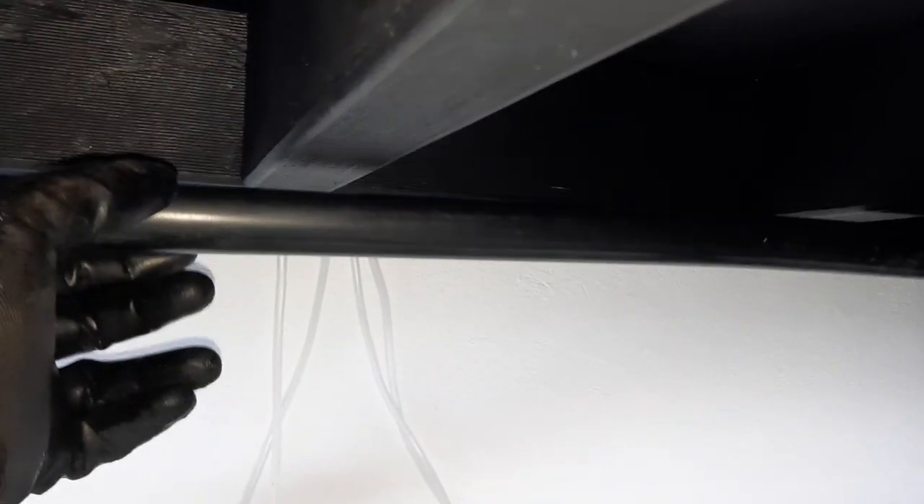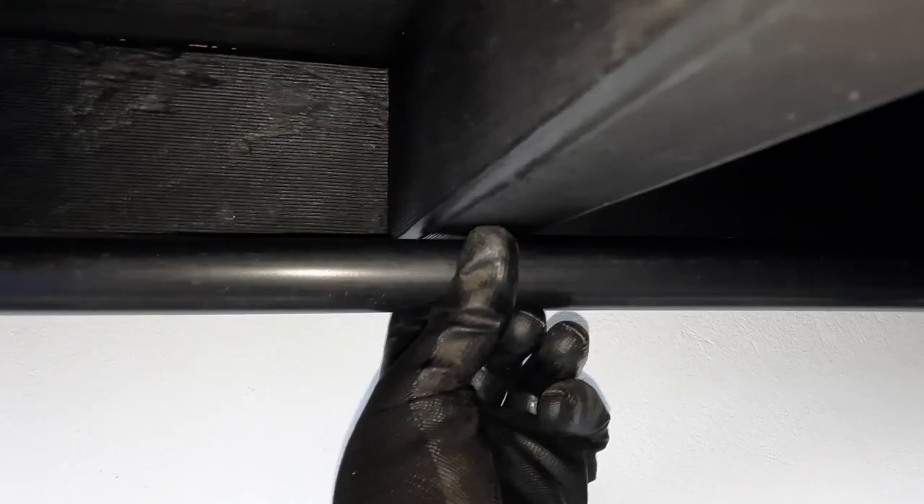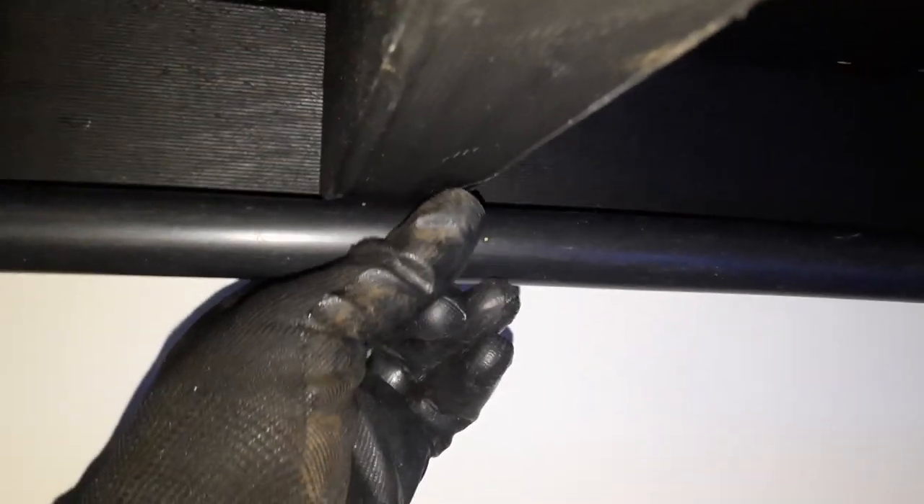For simplicity, I'll show this next bit with my mobile phone since we're moving down the length of the stand. You can see these fittings are now connected to the common drain line, which runs all the way down to the fitting on the other end. The next thing is to attach saddle clamps to this irrigation hose so it fits nice and snug. When it's full of water it's going to sag, so I'll be putting saddle clamps every few feet, screwing them to the underside of the stand. The saddle clamps will support the weight of the irrigation hoses when full of water.